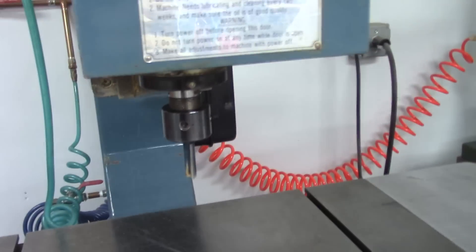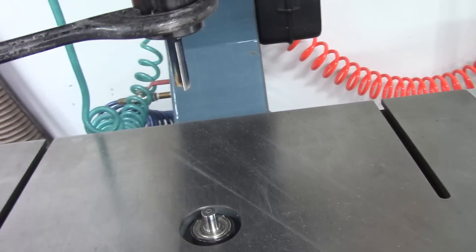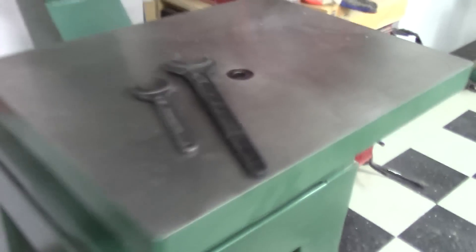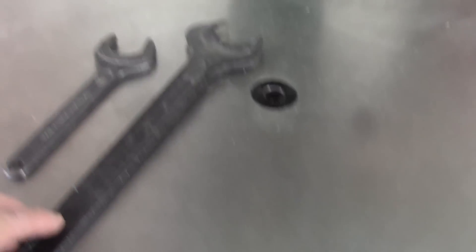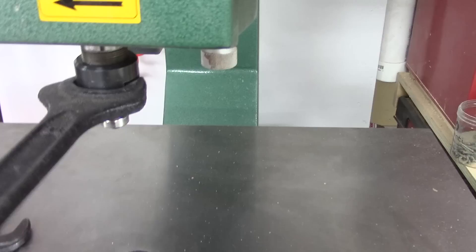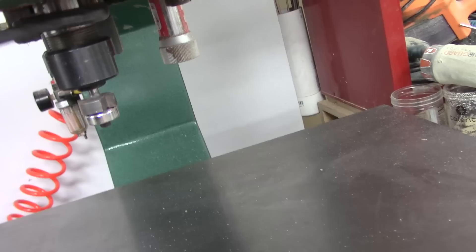The Jet bit removal tools are a little bit different. It has a tool that attaches to the pin, and then you need a 15/16ths wrench to change the bits. Same kind of deal on the Grizzly unit, only you have this kind of spanner — 36 millimeter on the outside and a one-and-an-eighth for this. They do not interchange, but that's okay because they come with the tools.